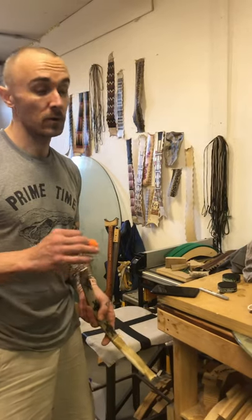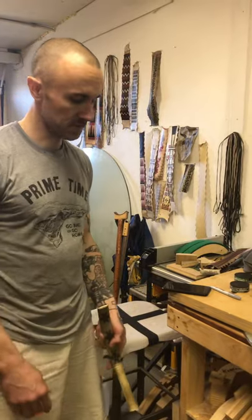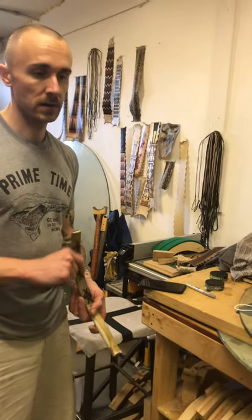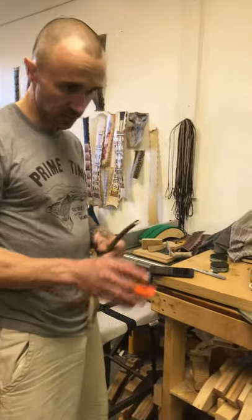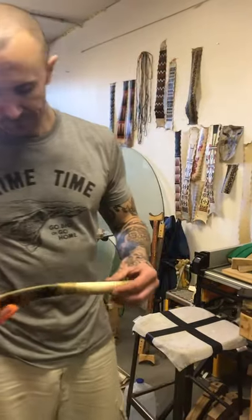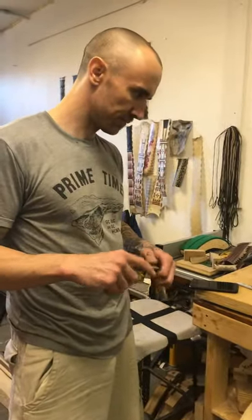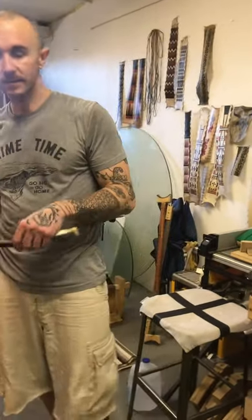You pick the wood before you even decide to bend it — you're not just grabbing any old tree out of the woods. You have to hand-pick everything. You have to select the grain and look at it and say, yeah, that's going to work. There can't be any wavy grain — it has to be really straight. So out of how many trees makes the cut? About one out of ten, one out of twenty — just depends on the area and if you get lucky.